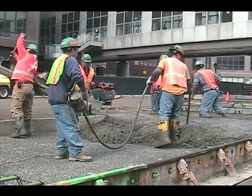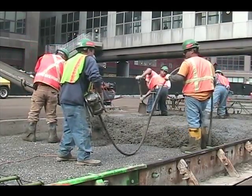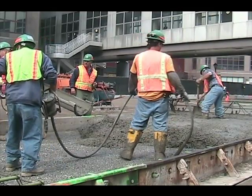The concrete is relatively stiff, which is very desirable, but it does make it difficult to move the concrete around. So you can understand why there's always pressure to add more water — make the concrete more flowable — which makes it a little easier on these guys who have to shovel it over the full width of the forms.